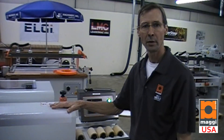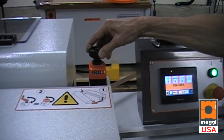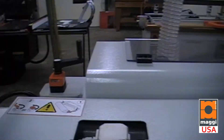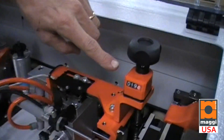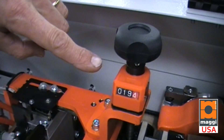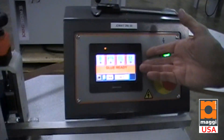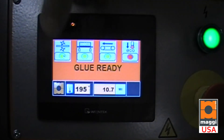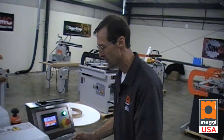When setting the machine up for a new product, you would measure the thickness of your part, set the infeed pressure beam height as well as the outfeed pressure beam height, and also the top trimmer. These are the height controls for the top trimmer — they should equal the thickness of your material as well. The glue is now ready, which lets me turn the other functions on. I'm going to turn the conveyor on, the end trim on, and the top and bottom on. Now we're going to process a panel through and see perfect results on the other side.